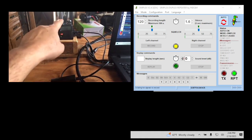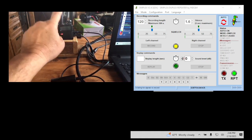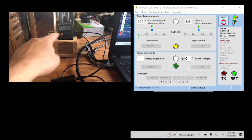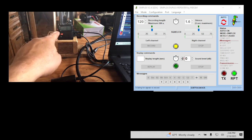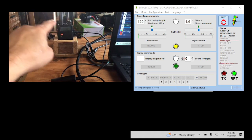You're going to need a handheld that's got a VOX setting. You need the VOX turned on and the VOX sensitivity set as sensitive as possible — check the menu. In this case I'm using a cheap UV5R Baofeng radio, programmed to my repeater frequency. Turn the volume all the way up. Since the repeater is behind me I don't need an external antenna.